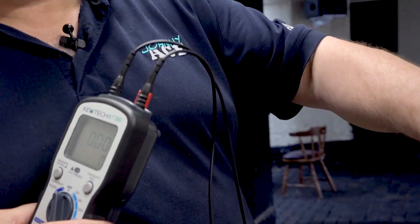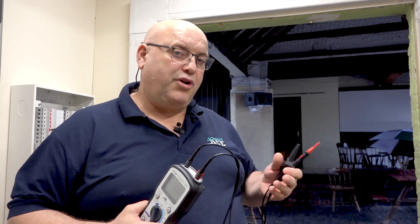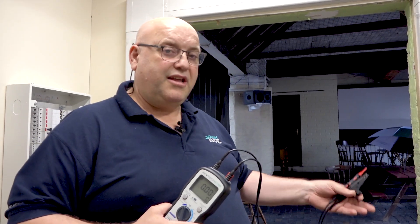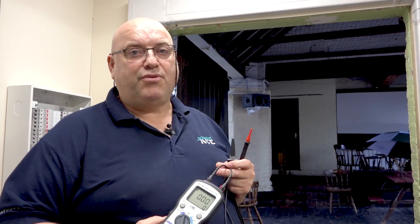It's as simple as that. Now we're just testing the one circuit — not a ring, it's a radial. What we're going to do is, most people link out at the consumer unit or distribution board, but I'm going to do it the other way around. Because it's all in one room, the cover's off the board, and we've isolated the individual circuit, I'm going to stay at the distribution board and have complete control. I can monitor what Paul is pushing into the socket adapter, and I can do the test from the board.